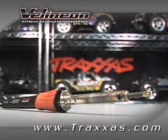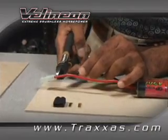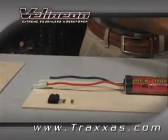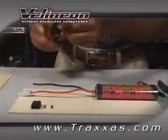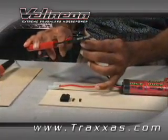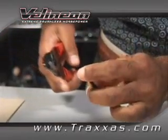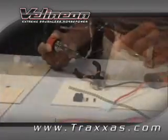First step is soldering the wire to the terminal. Begin by cutting the black wire. Be sure to only cut and install one wire at a time. You could short the battery with your wire stripper if you cut both the positive and negative wires at the same time. Go ahead and strip the wire insulation to expose about 1/8 inch or 4 millimeters of wire. Make sure you do not expose more than 4 millimeters of bare wire.